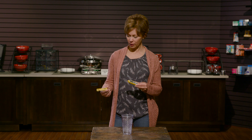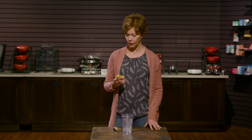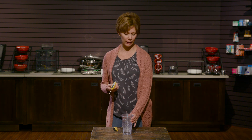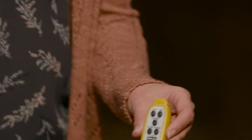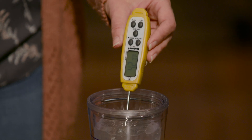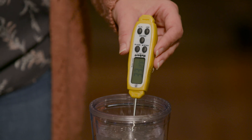So what you want to do is remove the protective covering. You do want to keep that on when you're not using the thermometer, because if you drop it, it's really easy to throw it out of calibration. Next, start with a nice glass of ice water — it's best to use crushed ice because you get a more accurate reading. Then place your thermometer in the water bath, making sure you don't touch the sides of the glass, or you'll get a reading of the sides of the glass.